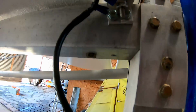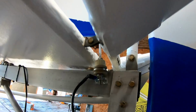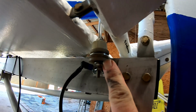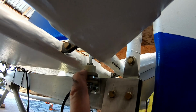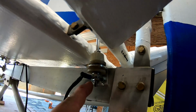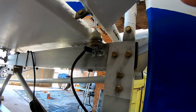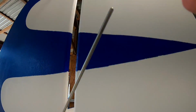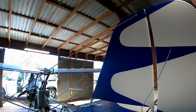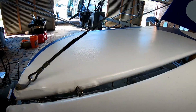And this here is our radio antenna. And we got one wire going right here to the isolation part. It's got little pieces of Delrin washers in here to keep it separated from the airframe. And then up here we've got a little ceramic isolator. And then this is the antenna wire, which goes through the shielded wire. And then we have the ground wire, which actually goes to the airframe. But it looks like that hasn't gone anywhere. And we do have good old cotter pins in there.